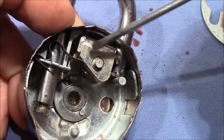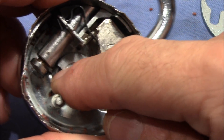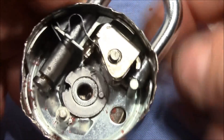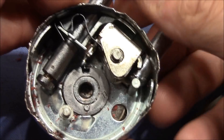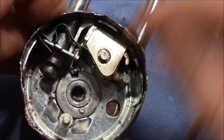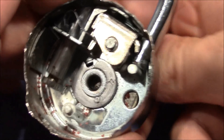The three layers of elastic band now push out this locking piece here. And when the dial is not at the right place where the cutout is, this piece here cannot go in — it's blocked by the wheel — and the shackle will not come out anymore. Now when you dial in the right code and all the gates are aligned, you pull on the shackle, the whole block turns against the spring tension and you can open up the lock. To close the lock, you push in the shackle and you can see this locking bar gets pushed against the rubber band, and it's locked up again.